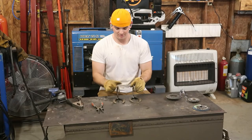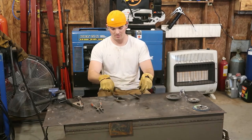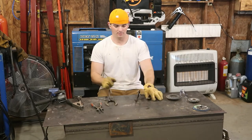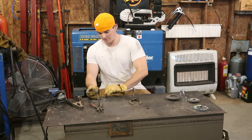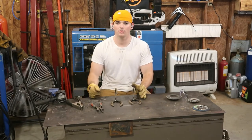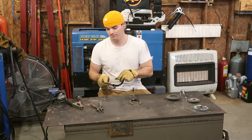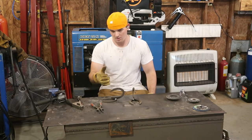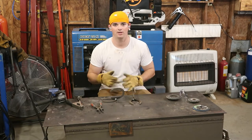Alright, they're both welded. I've learned this the hard way many times — if you're going to move something, remember to have your gloves on because it's still hot right after you get done welding. I think it turned out pretty good. This is bolted onto the wall and this creates a nice little hook — that's all my parents wanted, a nice little place to hang up the tack at the barn. Now, in the video we had a little bit of an issue with the ground. Because the horseshoes were painted with that rustic paint, it was really almost impossible to get a good arc going. What I ended up doing was ground clamp to the table and also on the horseshoe, which also didn't work. So I ended up taking a little weld and welding from the table to the clean part of the metal on the shoe — right after that it arced right up and had a nice slick weld.